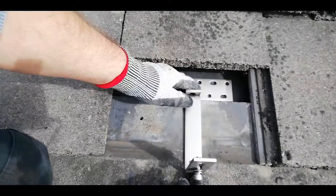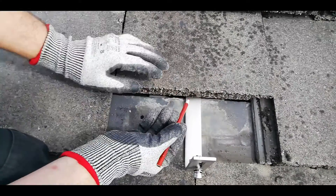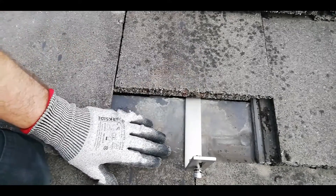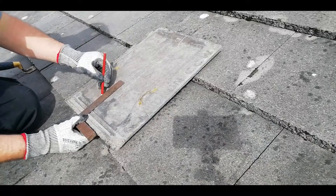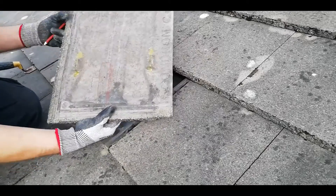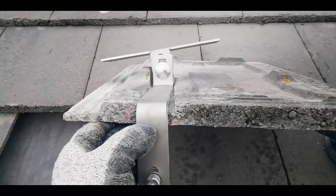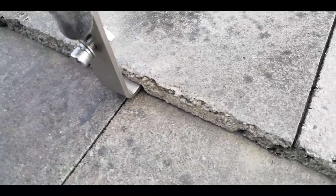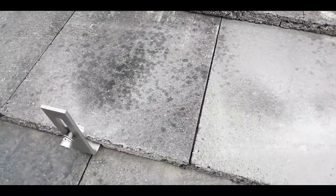It's fully adjustable so it's kind of okay, but the most important thing to remember when fitting this is make sure you don't lock it up pressing down against the tile, because once there's weight on that it could crack the tile. Leave a small amount of clearance — maybe just a couple of millimetres — to allow that bracket to sit up without putting pressure on the tiles. Slide your tile back down and make a little mark on the tile for a cut line so the tiles can sit flush with the bracket still in place.